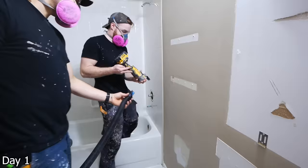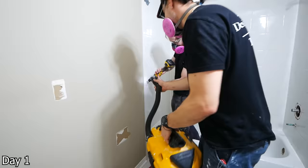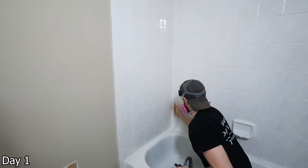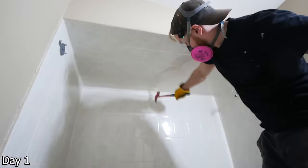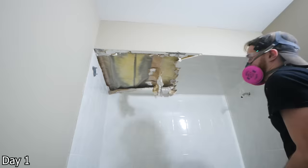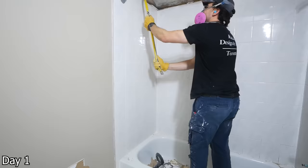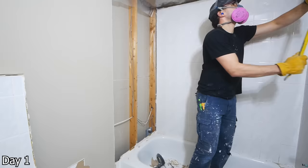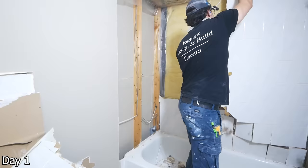To minimize work removing tile from the tub surround, take a multi-tool with a vacuum to reduce dust and score right along the tile where it meets the drywall. This way you can pull off the tile and backer board in large chunks, which is a lot cleaner. Once those two walls are scored, take a knife and cut all the silicone in the corners, then use a pry bar or hammer to start removing the tile. If you have a tiled ceiling, start there for safety — score a line with a hammer to get your hands above the backer board and slowly pull it up and down. If it's just drywall, which is common in older bathrooms, you can easily pull it loose from its fasteners. With cement board it's harder, but with enough smashing, pulling, and rocking back and forth, you can get it out in nice big chunks.